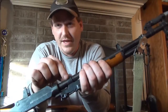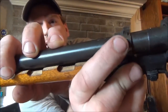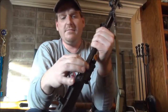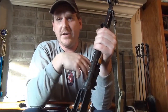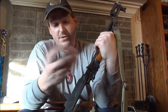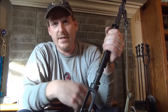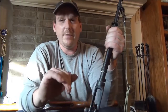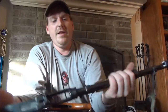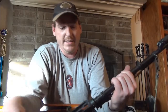We had to thin this one up a little bit — you can see some grind marks right there. Take a dremel tool and just remove a little bit of material off the side. Do it slowly; you don't really want to heat everything up. Just remove a little bit of material on the side and that'll make it so those magazines will be able to line up in there a little bit better. I've heard of people not having to do that, but I had to do it to make some of the magazines go in.